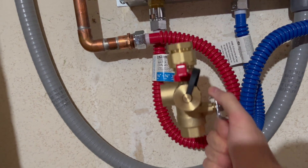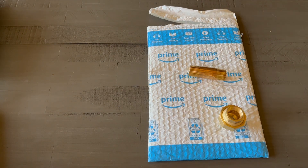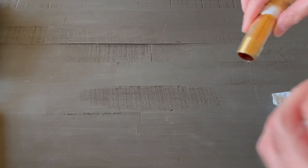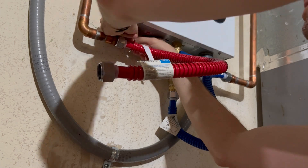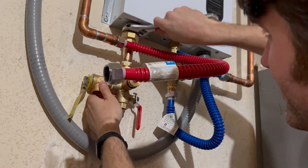As mentioned earlier, the copper hot water line is in the way of where I want the flush valve to be, so I need to add some pipe between the water heater and the flush valve. I did this with a brass union and a brass 3-inch nipple. Before I connect these to the heater, I want to connect them all together. As before, I used plumber's tape when attaching bare metal connections. Once I had my new contraption built, I hooked it up to the heater. You can see now how the valve handles will clear the flexible plumbing line thanks to the 3-inch nipple that I added.